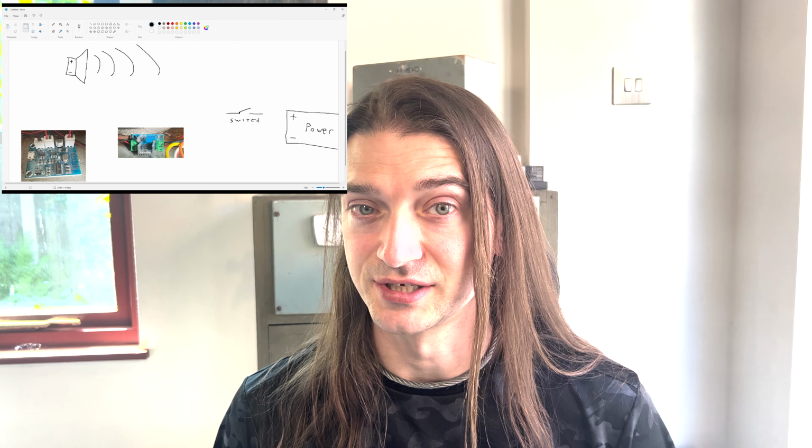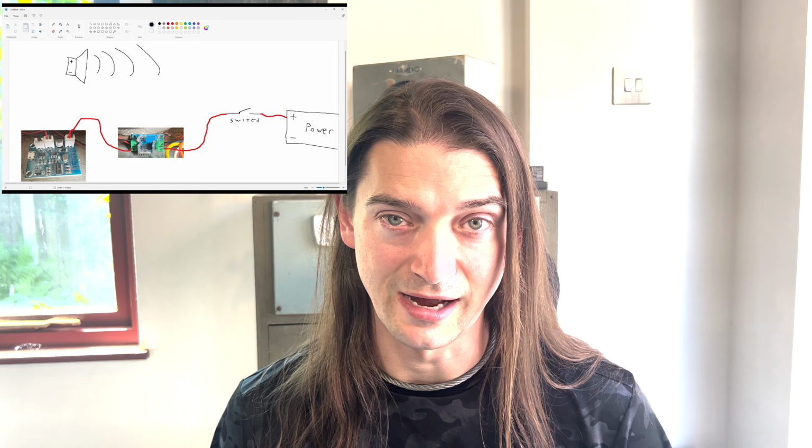The wiring diagram is so simple. The battery connector goes to the regulator, which goes to the voltage in on the Bluetooth, and the Bluetooth right channel out goes to the speaker. That is how you do it yourself. So simple. Let's try it out.